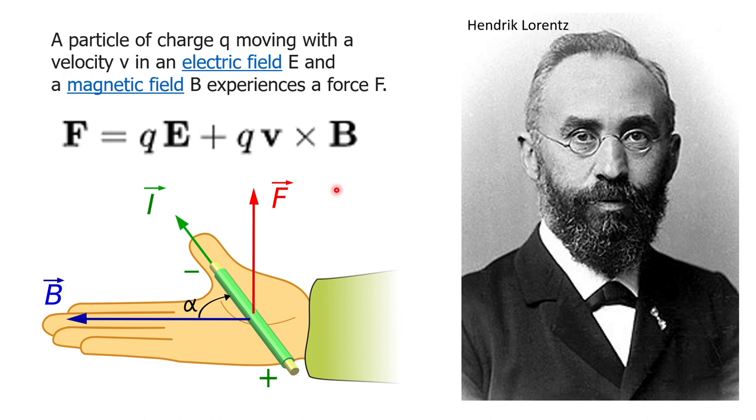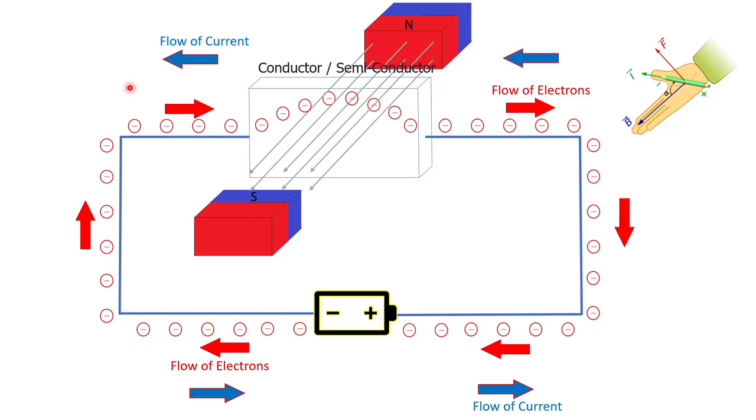This can be attributed to something called the Lorentz force, derived by the scientist Hendrik Lorentz. He basically said that if you place your palm such that your fingers are pointing in the direction of the magnetic field and your thumb is pointing in the direction of current, then those charged particles will experience a force in that direction. Applying the right-hand rule: if your fingers are pointing from north pole to south pole and your thumb is pointing in the direction of current, then the charged particles experience a force in the upper direction.